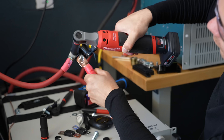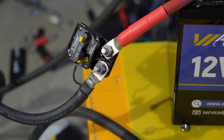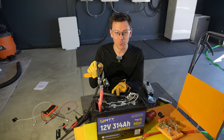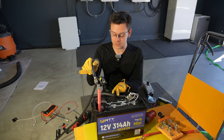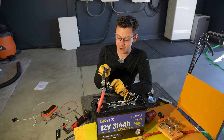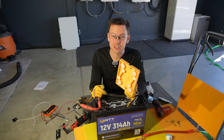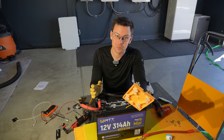This one survived. Final test — raw cells, 12 volts. So less voltage, smaller arc, but more current — and it tripped it perfectly. I can't believe this did not trip with the 48 volt 30 kilowatt hour pack. Those BMSs are limiting it a lot. And the arc I'm producing now is destroying the knife switch and everything I've used before it.